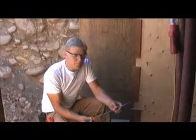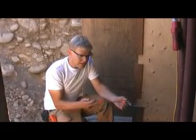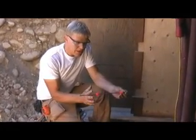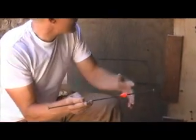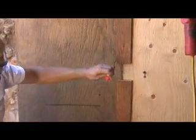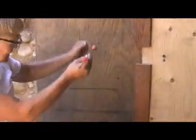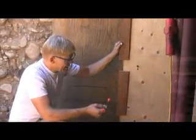I'm going to show you how to put in place conical ties. These are for concrete, of course. They have a tapered end, like so. These ends sit on the plywood like this, which is exactly what I have in the wall right here. You're looking at the end of this portion here inside the wall, so these have to be pre-fitted inside the plywood. Obviously, as you're putting it together, you do that.